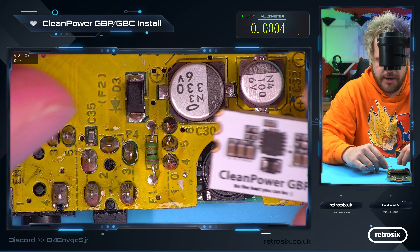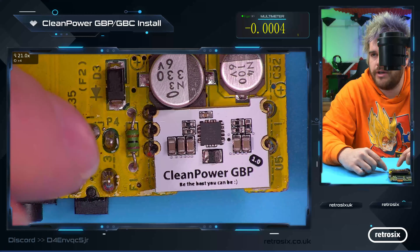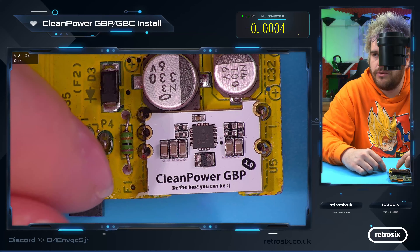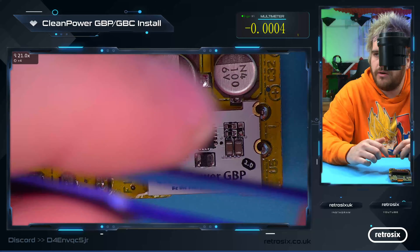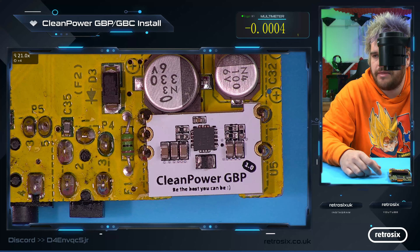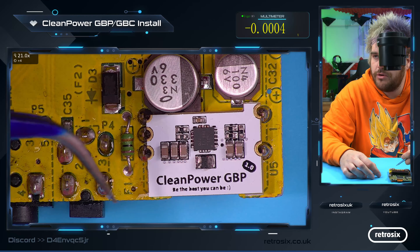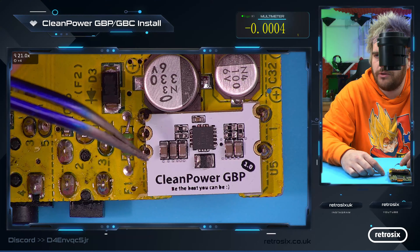So minus 18 volts. If I bring in the Clean Power, you can see it can work alongside the regulator by simply soldering it in place with the original regulator. You might just need a short piece of wire while it sits on the inductor. You would do this if you want to maintain the original LCD screen, or if you're using certain screens like FunnyPlaying screens that require this negative voltage rail to set the brightness. The only downside is it will be slightly less efficient. Removing the original regulator — if you plan to use IPS screens that don't need the negative voltage — is the best way to go.